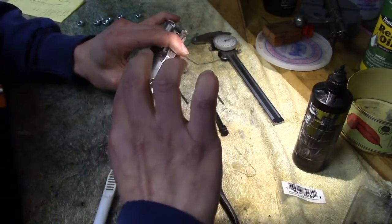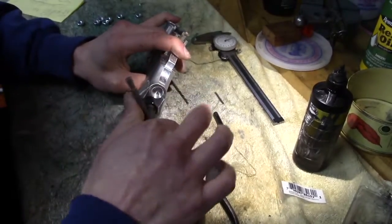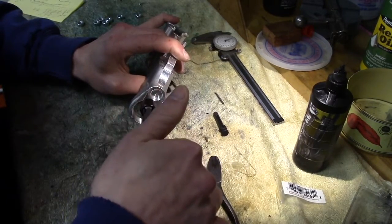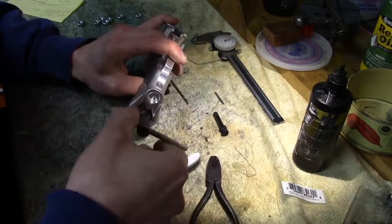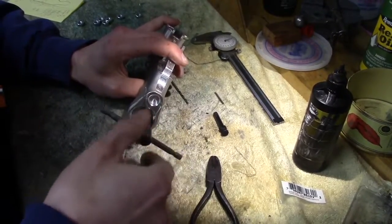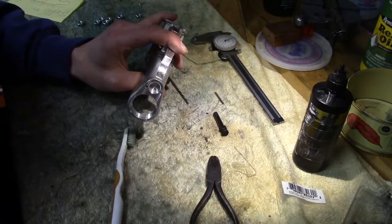So as we just talked about — go a quarter, back out, back that out halfway. You can feel it cutting there. And then one more quarter — and that is that. That should do it. I'll just give it an extra quarter turn because I'm particular that way. Get this sucker out nice and easy, making sure we don't gall up the threads or kill them.